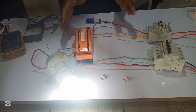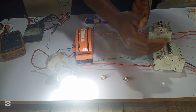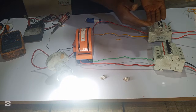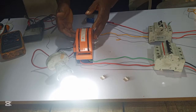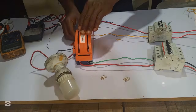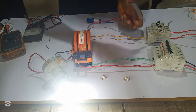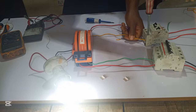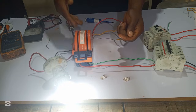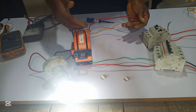It's very simple to connect — no need to pay anybody for this. All you have to do is connect from your utility breaker to the upside, and from your generator fuse or breaker to the downside, then from the output side connect your load. Even if I change it like this, I can loosen this wire and touch it and nothing will happen to me, because NEPA and generator don't work together — they don't supply at the same time.